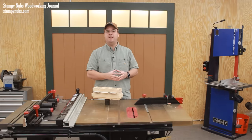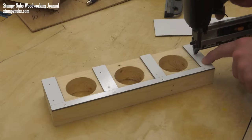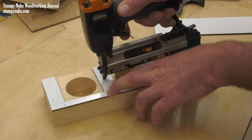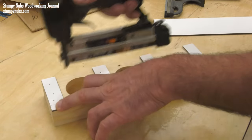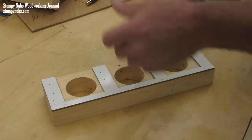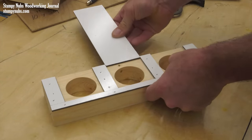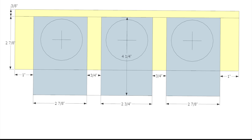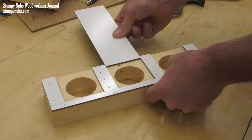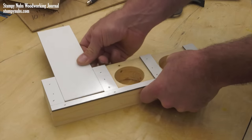That leaves the single remaining three-hole workpiece. On that you'll attach some pieces of thin material — I prefer eighth-inch hardboard or MDF, something that's smooth on both sides. You could use quarter-inch material if that's all you have on hand. Here are the dimensions and placement of the strips — make sure there are no gaps between them and use glue, not just nails. Now cut some rectangles from the same material to fit between the strips you just mounted. These are the blast gates. You can refer to the dimensions as a guide, but you may have to make small adjustments so they fit well yet slide in and out easily. Each one may have to be custom fit to its spot, and some sandpaper will be ideal for fine-tuning.